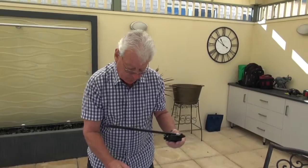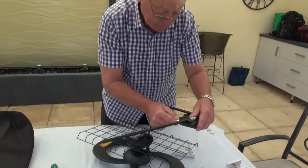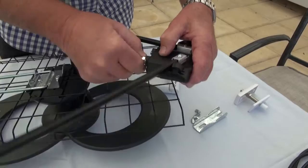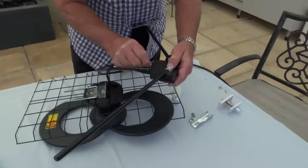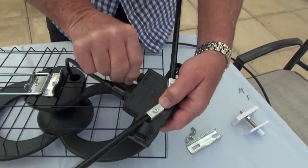At this point it's easier to put this on before you attach the element. This UHF cable coming from the UHF element is to go into the UHF in, which is quite clearly shown on the back of this element. Just tighten it up finger tight and then attach the boot. Then take the long cable, screw that up the same way into the UHF VHF out — finger tight — and attach the boot. Everything is now put together.